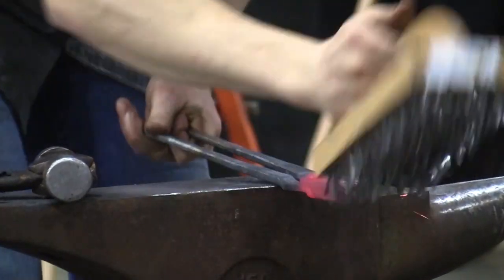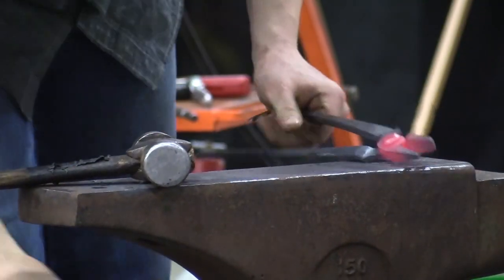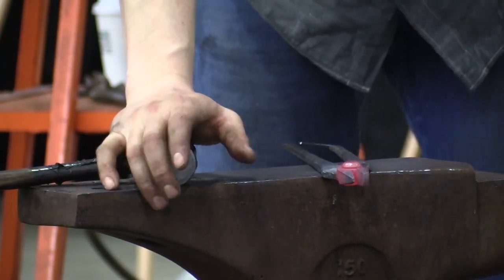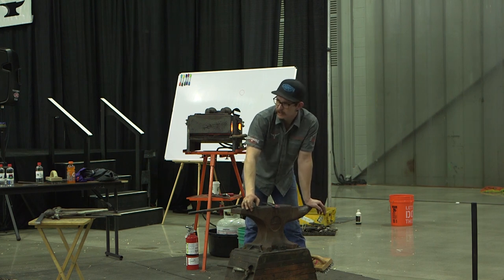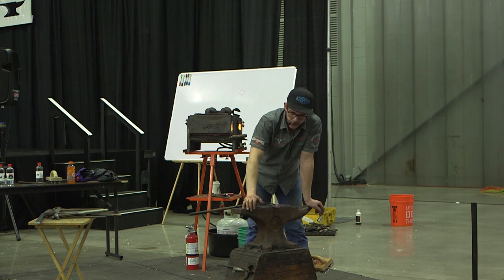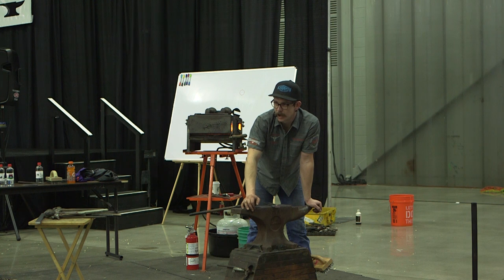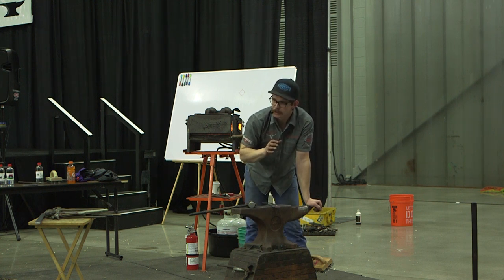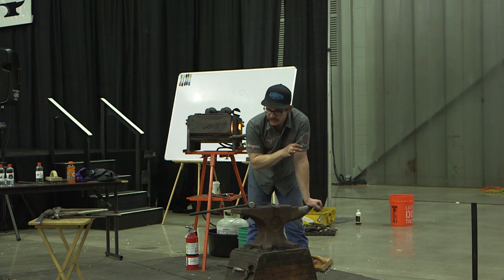So I came out with a good spot on these, I think. Because when we're gonna fit these up now, and when you're fitting reins or fitting tongs up, it's really hard to go down sizes. So if you got a pair of tongs that were half inch, now they're kind of big, you're thinking like, well, I need 3/8 tongs, you're kind of human, you're gonna probably wreck some stuff. It's not gonna come out real great. You're gonna have a gap in the back of the jaws pretty much always. You're either gonna do that or you're gonna ruin the rivet side of it. So it's really easy to size up.